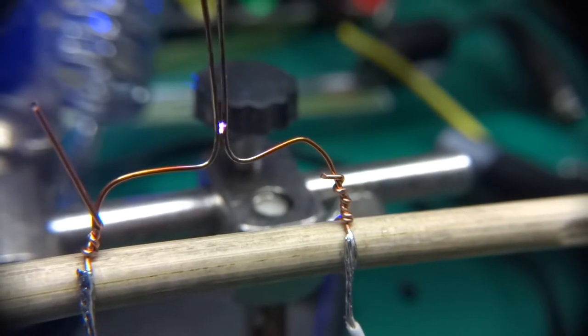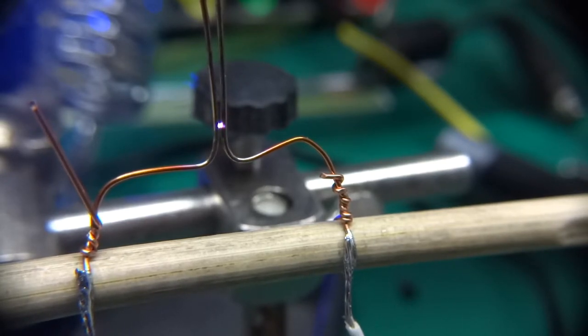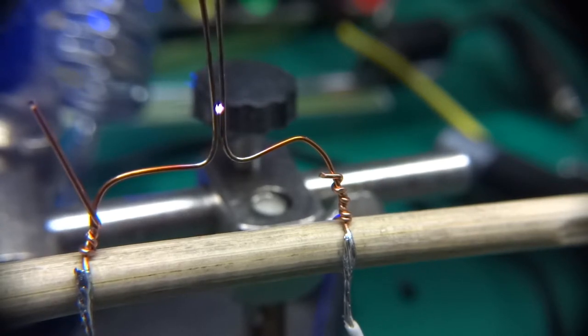Producing an arc discharge, so judging by the length, there must be at least a few kV on here. Obviously this is really, really small power. I could make a miniature Jacob's ladder out of it maybe. Okay, there we go, why not, because we can. Here is probably the world's smallest Jacob's ladder, made out of the cold cathode tube drive. I've just literally taken two pieces of copper wire and connected this to the output.